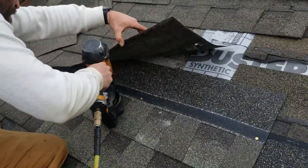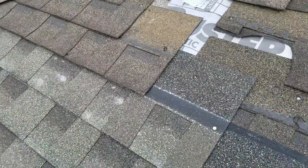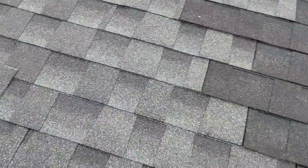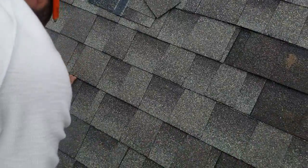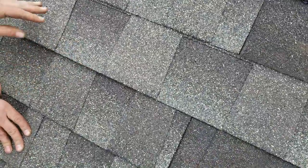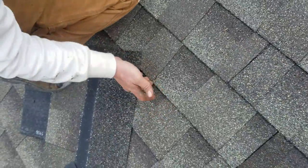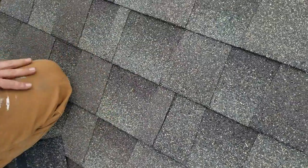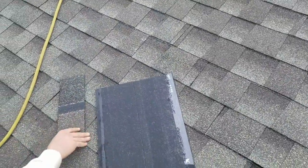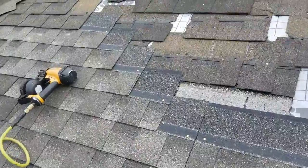We're going on really good, and I want to point something out here. Look at this — I just shingled these not too long ago, and I can't get these up. It's like 40-something degrees here, no sun. So they ain't fooling around about how good this stuff sticks. Definitely going to want to not leave those out in the sun too long.